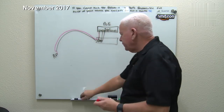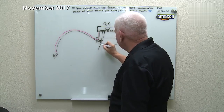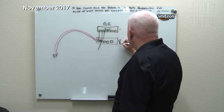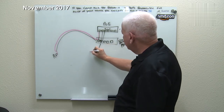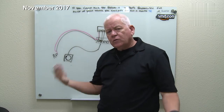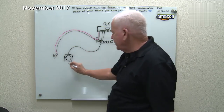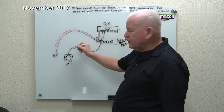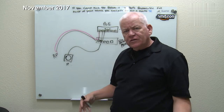PoE can also power a camera. You can have a port on the patch panel going to an IP camera and it can power the camera over the same cord. There are no special cords or special patch cords needed — it just goes over the existing system. So you don't have to re-cable your whole building. You just need an IP camera capable of receiving Power over Ethernet.